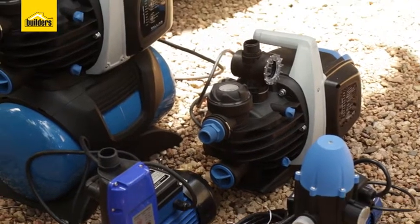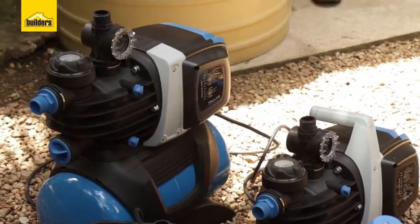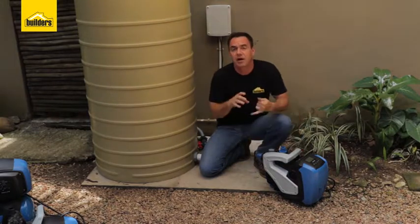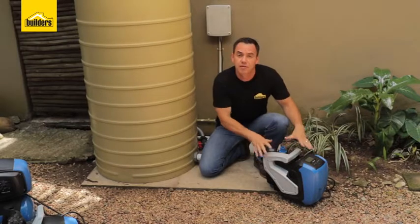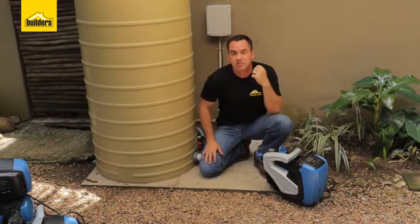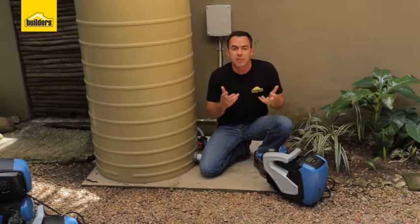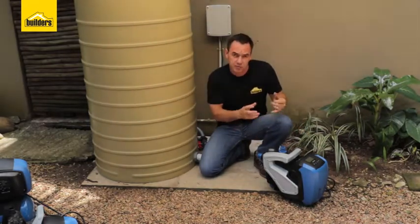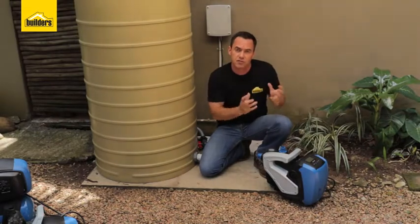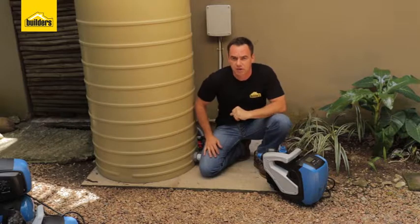When it comes to your pump selection there's a wide range to choose from. You can start off at the entry level working all your way up to the top of the range where you have a higher flow rate and a higher pressure. I've selected this particular pump for this application as this house is a large house with numerous users — a lot of people are going to be using the taps at the same time. This pump has a variable speed drive and it'll pick up that pressure difference when somebody else opens a tap, so you won't notice that pressure drop in the shower.